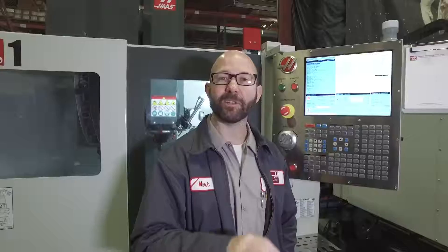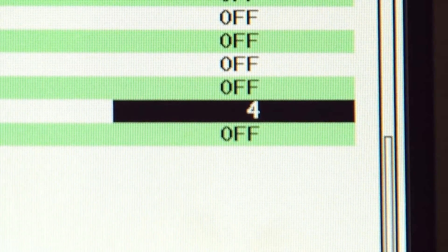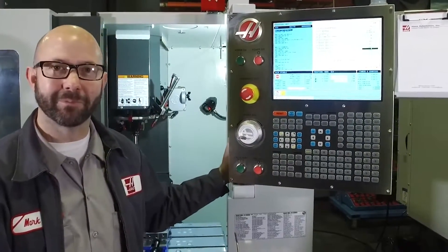It is currently set to 1. Setting 130 will accept any value between 0 and 9. We've chosen 4 because it's a good place to start for most tapping applications. If you've got a long tap, you might benefit by going higher — you'll need to experiment. Changing that 1 to a 4, retracting at 4 times the speed, I can save 13 seconds per part. That's more than 3 hours in a month.